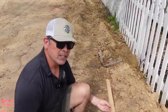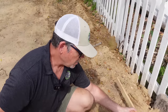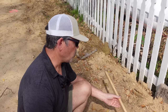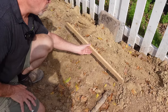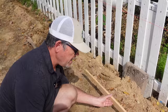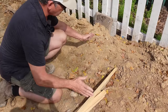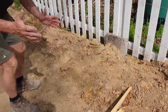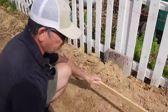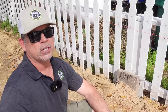We're going to establish some batter boards — you've all seen these on construction sites, maybe didn't know what they were called. They're called batter boards, also known as corner boards. It's simply a horizontal board at each corner. We're going to make the top of this board the top of our slab elevation. These boards will be reference points where we put our string, and that string will represent the edges of our foundation. Before we can put these up, we need stakes — 12 in total. Let's get the circular saw and make some stakes.